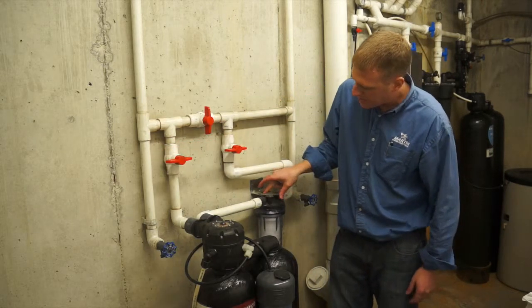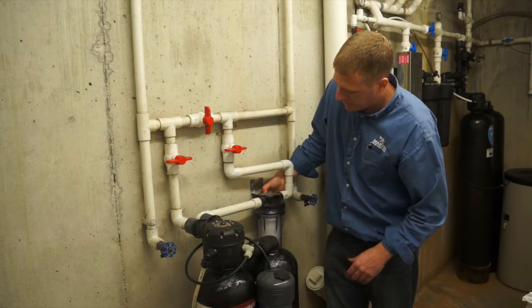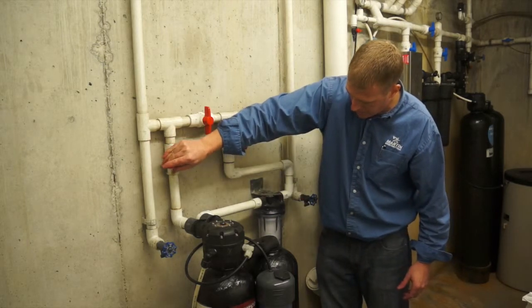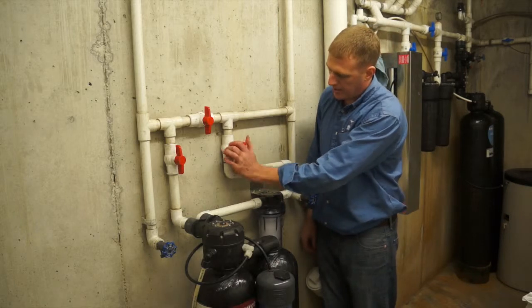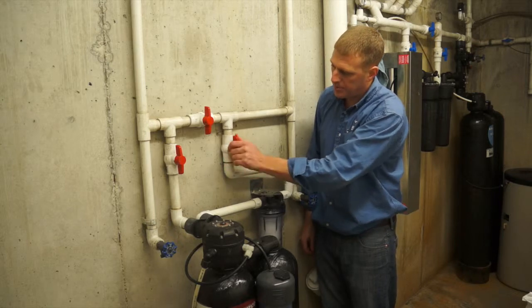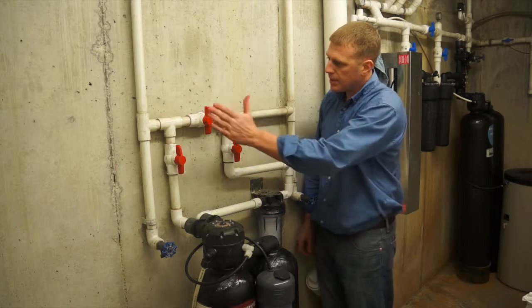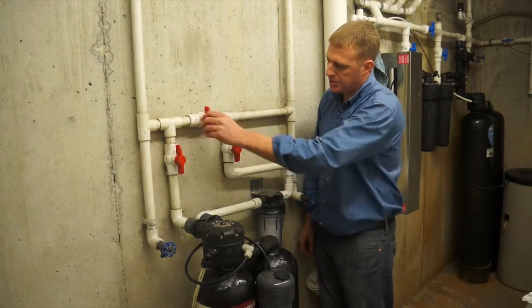And I like to press this pressure release back here. Just give this release of pressure. Alright. After that's done, turn the valve on the whole way, turn the outlet valve on. Notice a little bit of air that was still left in there, no big deal. That'll go out of the faucets. And you're done. And just double check our valves, bypass closed, inlet, outlet open, and we should have water on in the house.